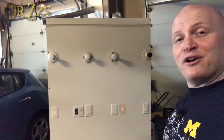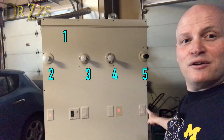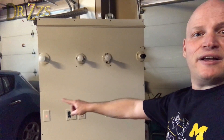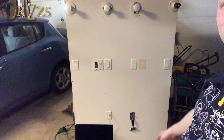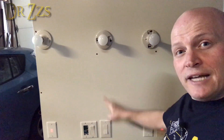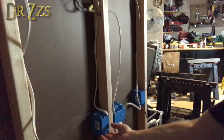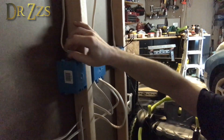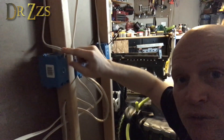Here it is, our Maker Faire display wall. We've got five different lights and six different light switches, plus a couple of Sonoffs down there. This next switch here is the example of having only wires from the light to the switch. If we go around the back — if you look at this switch box, the only wires going into this switch box are these two right here. That's it. So there's no power going to this switch box, but one Romex with two wires in it.